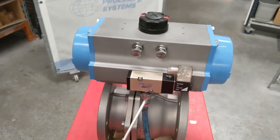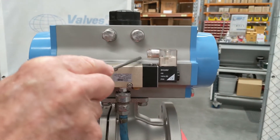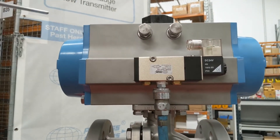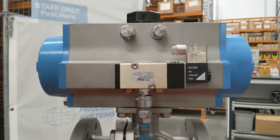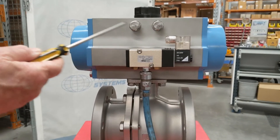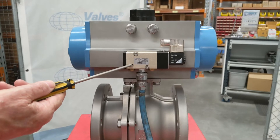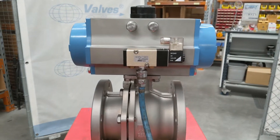We have air going into both sides of the actuator for spring return and double acting. We put air into both sides so the spring acts as an emergency close, but we supply air to both open and close sides. The reasoning is that the actuator is effectively double acting with springs. This way we get clean, filtered air going into both sides — if we used a three-way valve operating in only one direction, we'd suck contaminated, dusty air into the opposite side, which is not good for the valve.